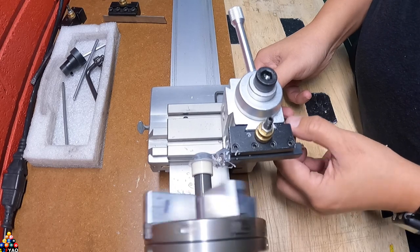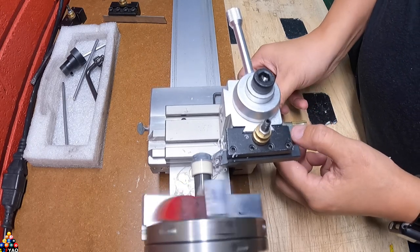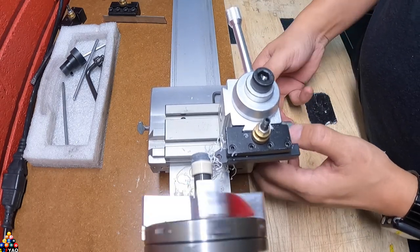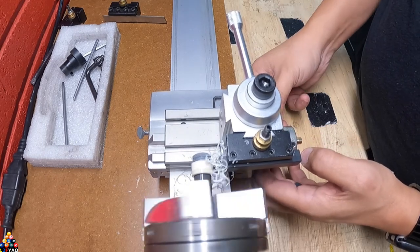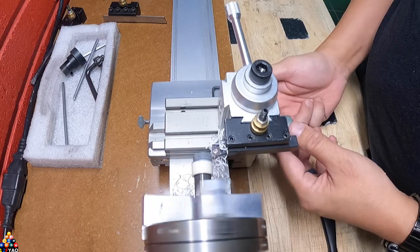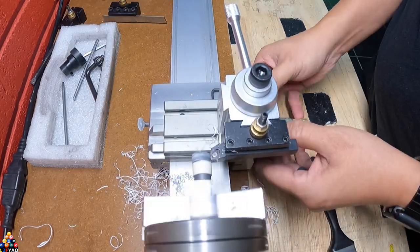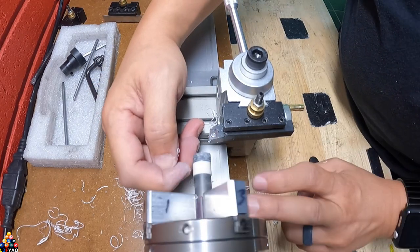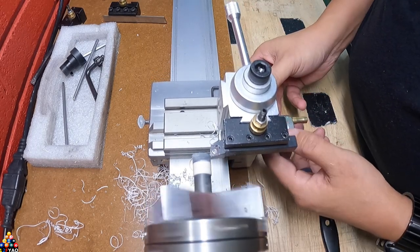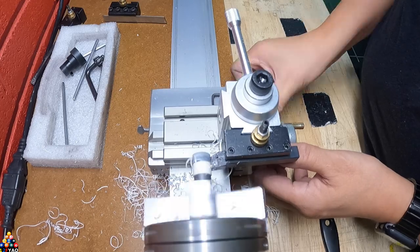All I'm doing is getting the acrylic down to size. Now I can get the ferrule close to the shaft diameter, along with the tip. Try to get this as close to the ferrule. Now I don't have to work as hard. Get the ferrule close to the shaft. What I meant.